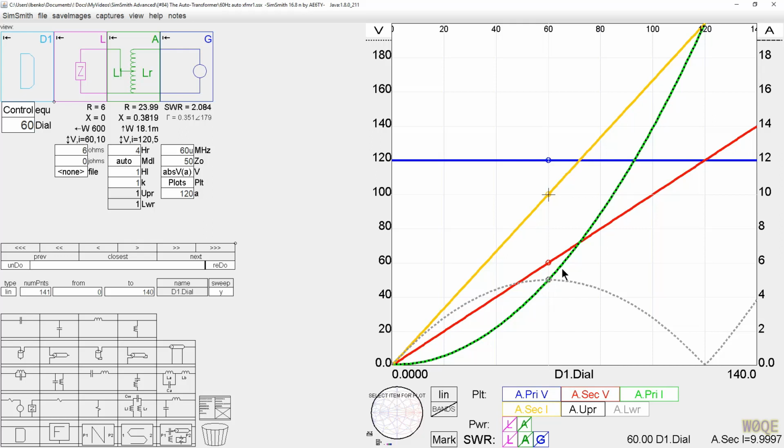If our fuse is in the primary line, which it must be, we must have a fuse here if the Variac is a standalone Variac, because some fault in here would allow a huge inrush of current from the mains, and that's not good. So for safety reasons, we want a fuse here. What can we do to protect the Variac? We are going to have to fuse the output side too. And then if we fuse the output side and the input side both at 10 amps, we're safe to go.